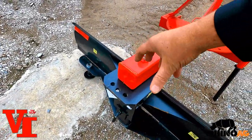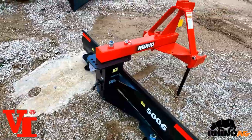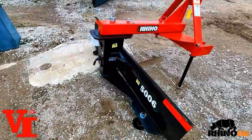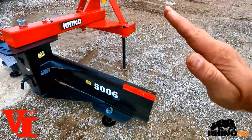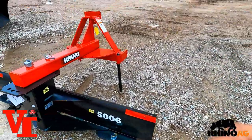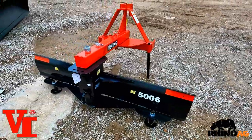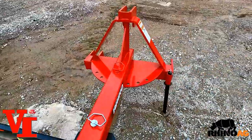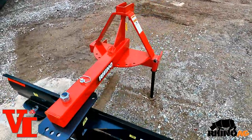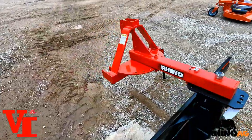That is probably the second biggest feature of the blade direction. This is also the best tool to cut a ditch — by using the tilt function, you can tilt that blade down into the ditch, tilt it forward, and it's going to clean the ditch out and pull material up to the left or right depending on the tilt. Those are the three big positives, plus offset — offset allows you to do work to the right or left of the tractor without having to drive in that area.